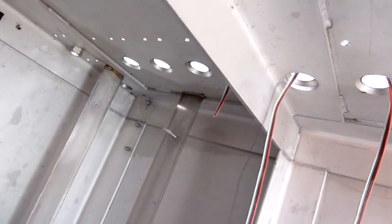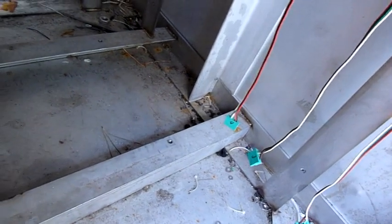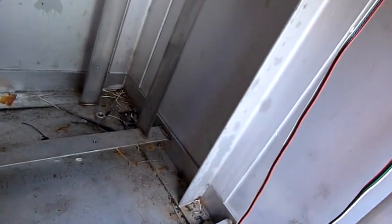I might even get the 4-inch grinder out and knock some of these straps off. Those flat 50 by 6mm flat bar is quite handy, especially in stainless steel. So I might get the 4-inch grinder in here and cut those little TIG welds - those welds are very cold, light penetration welds, so only a slight score is all it'll take to break them, and then I can rip those bars out. I'll scab some of those bars before this thing goes - get my money's worth. I'll look at the weigh heads and things tomorrow. I'll rattle them off and then we'll look at them separately, along with the rest of the control boards. Thanks for watching.